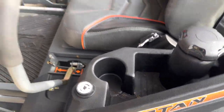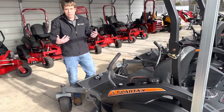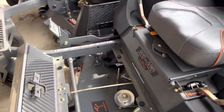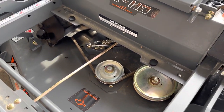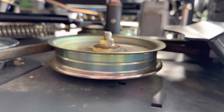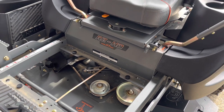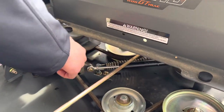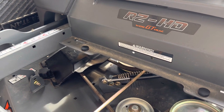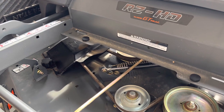One thing Spartans are known for is not only the strength, the weight distribution, the balance, the cut, and the ride comfort — but things are also easy to access, easy to clean, and easy to maintain. This floorboard comes out and you can see our inch-and-a-half by three-inch frame rail really well. We have split metal pulleys — it starts off as one piece of metal, the machine cuts and splits the end, rolls it into shape, machines out the center, you press in the bearing, and then a patent dust cap goes on top. That gives you less flop and less wear and tear — it's a very strong pulley. We also put a deck dampener here next to the outer spring, which keeps the belts from bouncing around as much, smooths it out, controls vibration, and helps prolong the life of the machine.